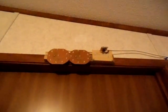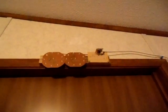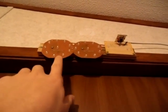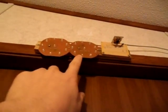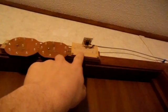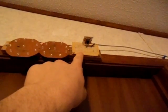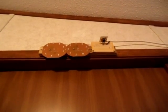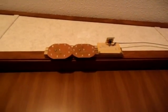A couple weeks ago I was able to build a 12 volt LED light — you can see it right there. It's just two six volt lantern light bulbs wired together in series. Right here is a 12 volt voltage regulator circuit I built, which allows me to put up to 37 volts DC in and it outputs a constant 12 volts.